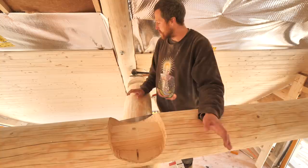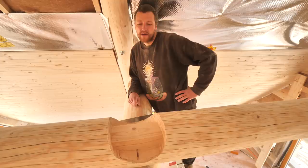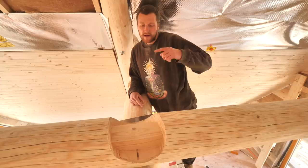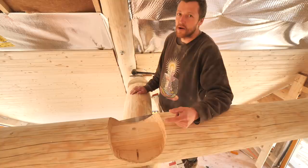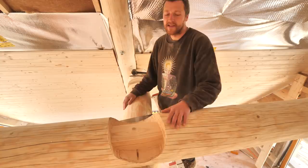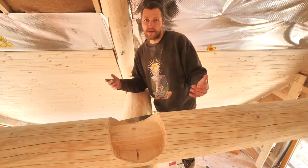And probably many of you are asking yourself why I'm doing all of this without using the chainsaw. The main reason is that when using the chainsaw, even if the chain is just spinning freely, it throws around a lot of chain oil, and I cannot do that here now, because the oil would go all over these final boards and on the ground, and it wouldn't be a good thing. And the second thing is that the exhaust fumes of the chainsaw that get stuck here inside the house are really not good for breathing.